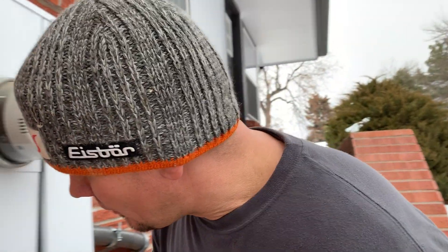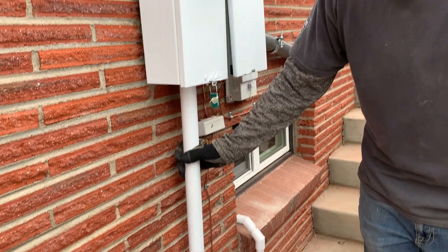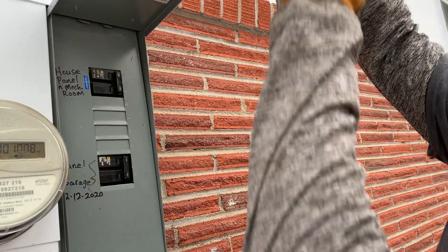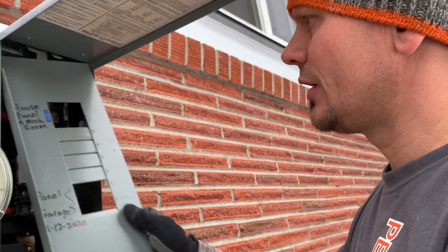This video is going to be about TC cable. It's number two aluminum or number two copper for conductor, and it's going to be feeding a sub-panel off of the garage. I did not want to come off the second panel in the mechanical room, so I fed it like a V straight out from the main service. They would like to get this upgraded — this is an inch and a quarter mast built in the 50s. This is a number four aluminum, I bet. It's only good for 125 amps based on the utilities here, and this cabinet is only good for 125 amps itself.